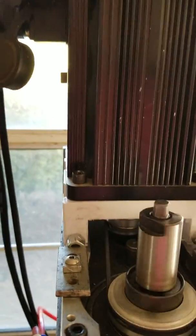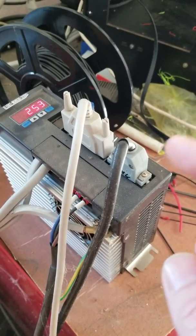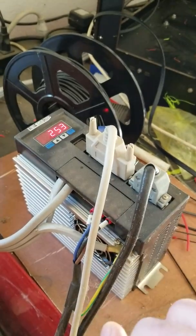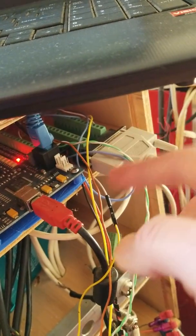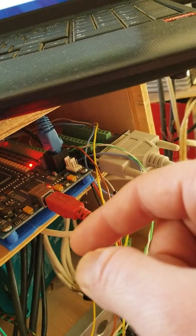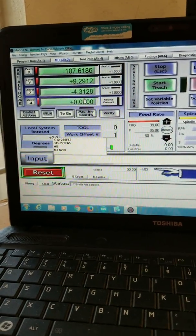It has cables and it's all sealed — you don't need to do anything special. I'll show you the driver. The motor is connected to power there, this is the encoder connection, and this is a parallel port that I pulled out to the controller. I only use a couple of pins — you can assign alarms and all kinds of things as outputs. For now I have the enable pin for the spindle and three cables for step and direction. I can control it easily — forward, backward, and all kinds of stuff in Mach3 with M3 and M4 direction change.